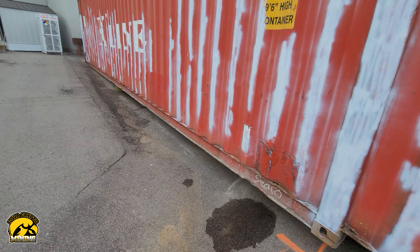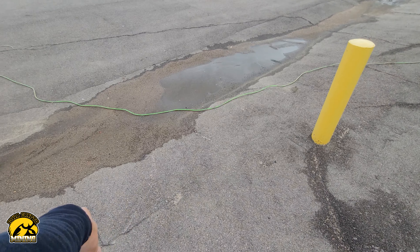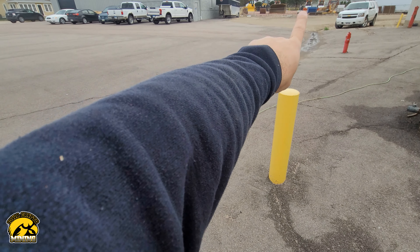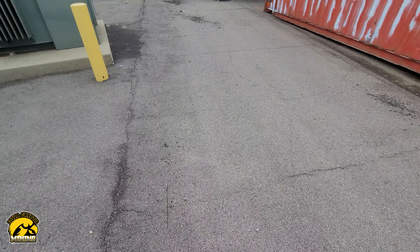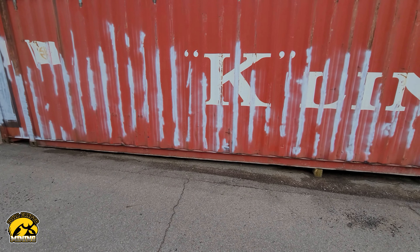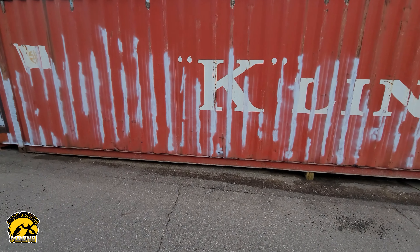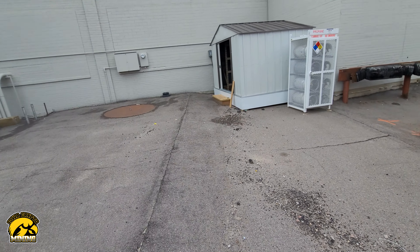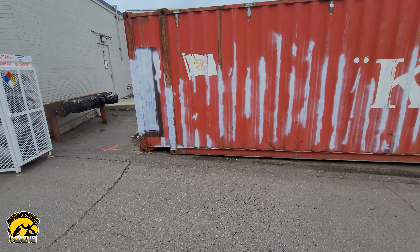To protect the filters and keep them running well, we're going to do something about this. We're going to scoop all this stuff up and get it out of here. We're also maybe going to pay someone to do an oil-based layer treatment — like what they do on gravel roads a couple of times a year — which keeps dust down drastically. The cost of doing that was actually much less than replacing the filter once or twice. That's probably what we're going to end up doing.